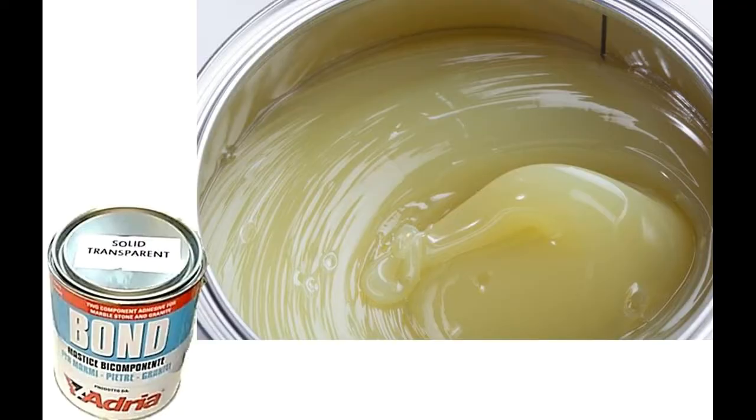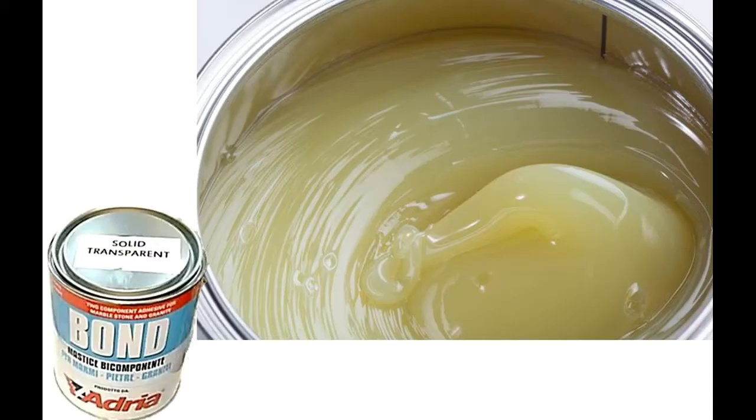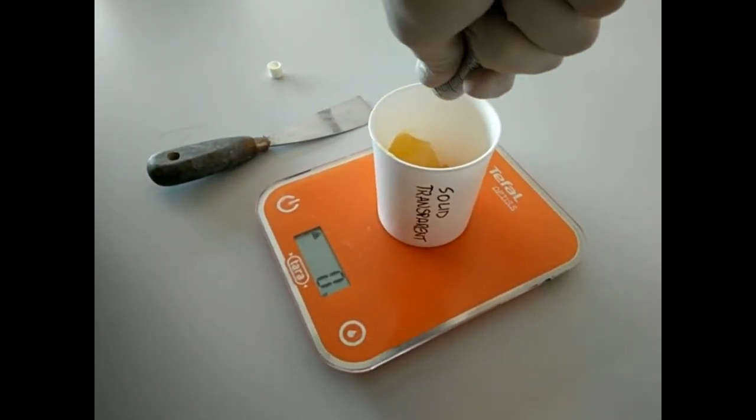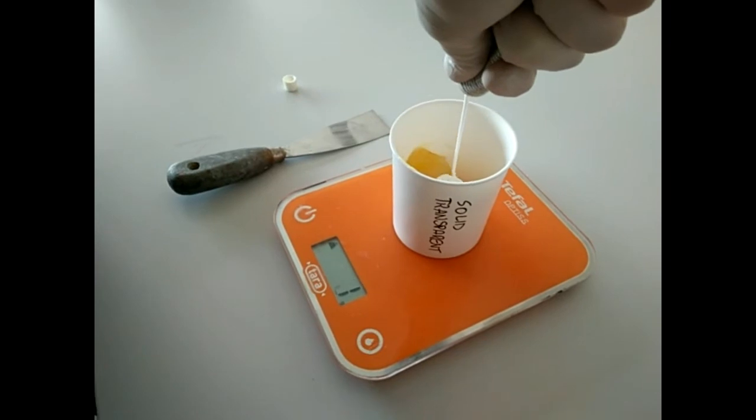The first product is the solid transparent mastic. It is an Omni Color mastic, the most popular product. It is fast, with a drying time of more or less one hour depending on the environment conditions, good adhesion and performances. To use, we add 3% of white paste hardener.